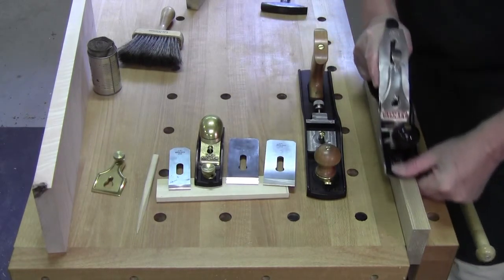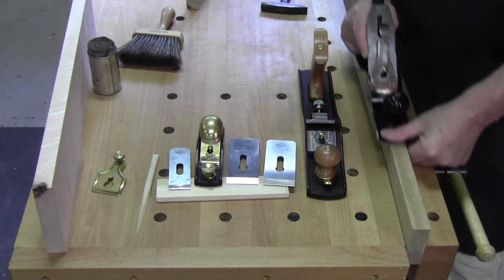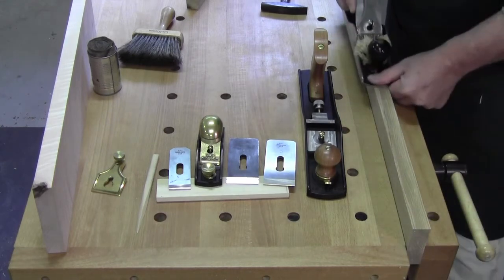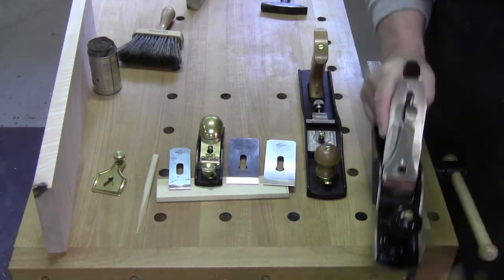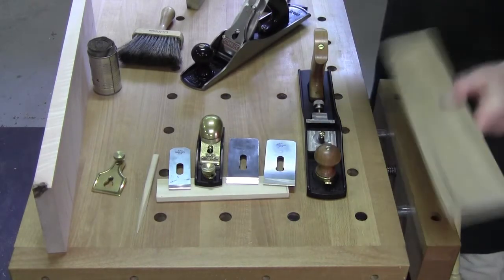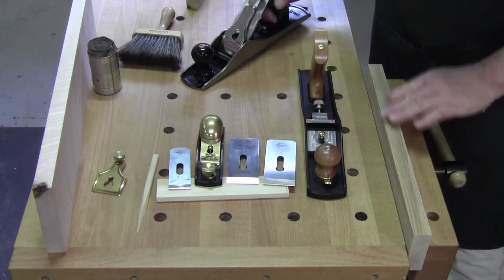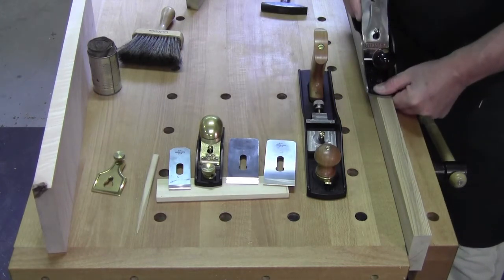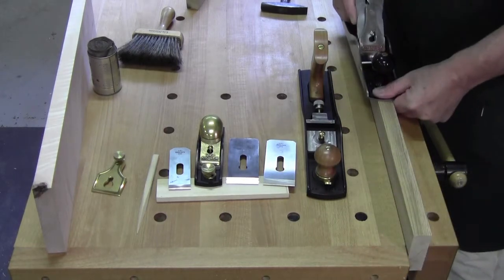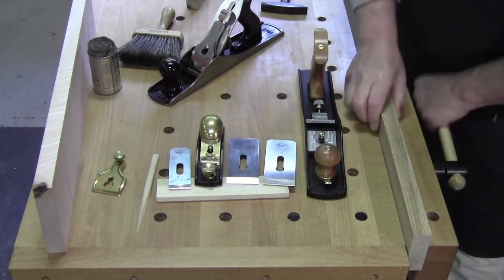So here we have some butternut. Okay, planes absolutely beautifully with the grain. It's almost as if there's nothing to resist it. We turn around 180 degrees. Now we're going against the grain. A little bit more resistance, but still tear out free. Okay. So,